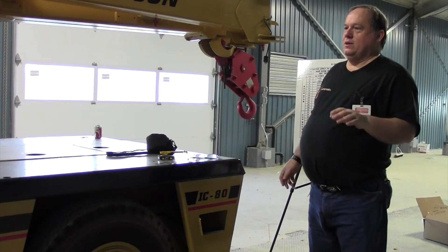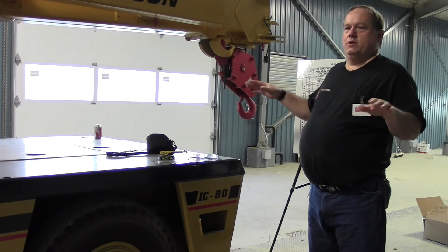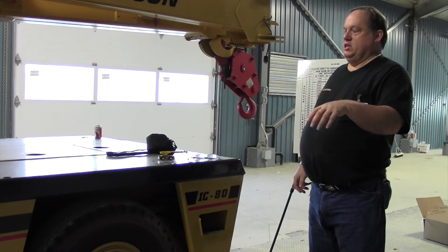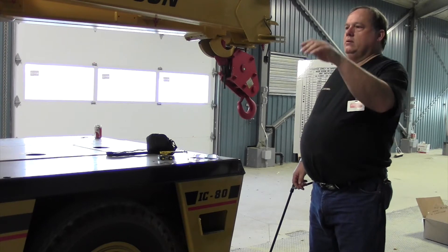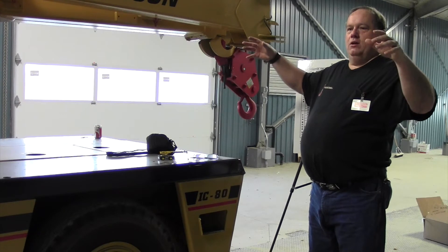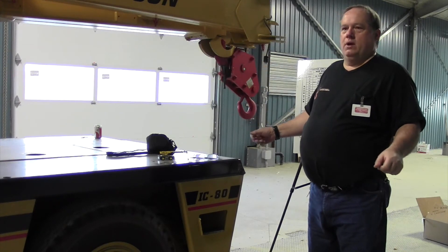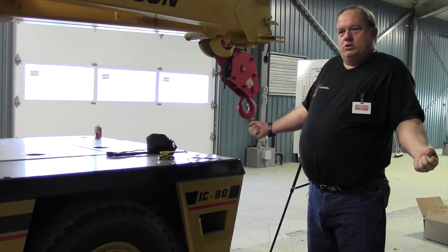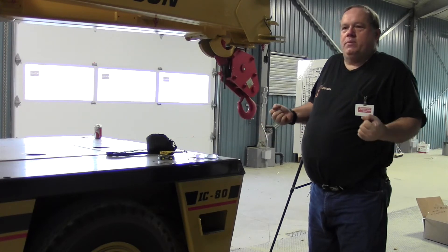If you have a really nice concrete floor like this — it's a brand new floor — and you put the crane on it, for example, we took the crane into a place where we were picking up a CNC machine used to cut granite countertops. We pulled the machine up to the pit, picked the unit up, put the outriggers down, swung it back closer to the crane and got the unit up over the front end of the crane. Then we went to pull the outriggers up, but there was too much friction because the floor was so new. The crane doesn't have the power to slide the outriggers across the floor to retract them.